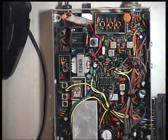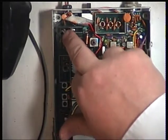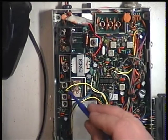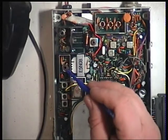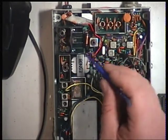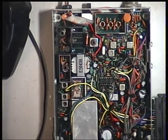So that certainly brought it up half a watt, and in this radio's case it was that one which was out. So I'll just go through those again. It was T3, T2, T1, L8, L5, L4, and then variable resistor 1 to set for 4 watts.